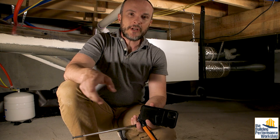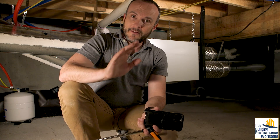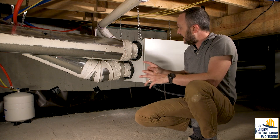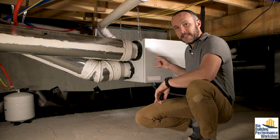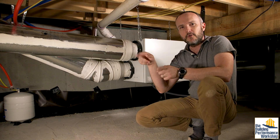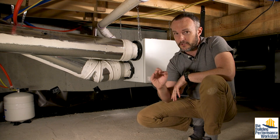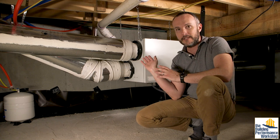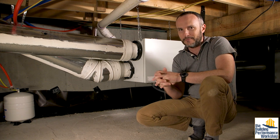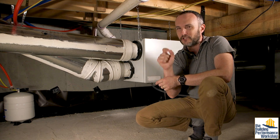This relationship will change as the supply and exhaust filters get clogged, which is why it's really important to continue to clean the filters. Depending on the brand, Fantec wants you to test in the duct. Some brands have pressure ports built into the face plate of the ventilator, where you do a simple pressure drop measurement across the core using a fan curve. Make sure you have the right tool — if you're doing pressure measurement, you may want a home performance pressure gauge rather than an HVAC pressure gauge, since HVAC gauges run in inches of water column while home performance gauges run in pascals, which are much smaller.